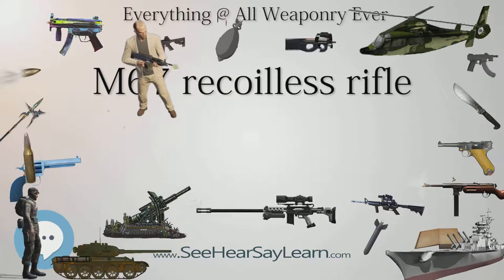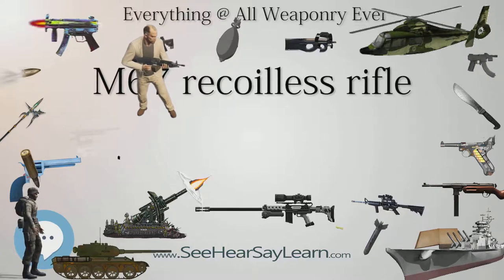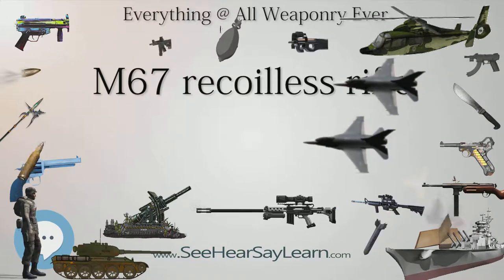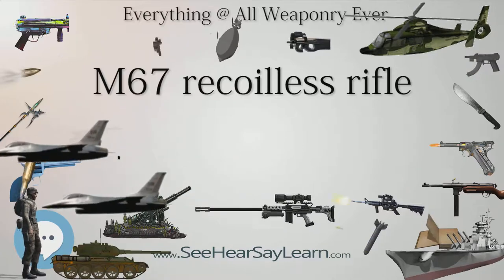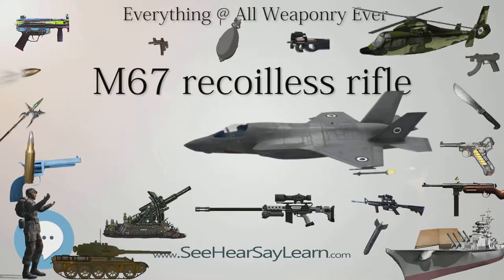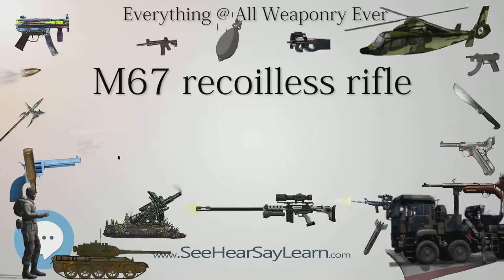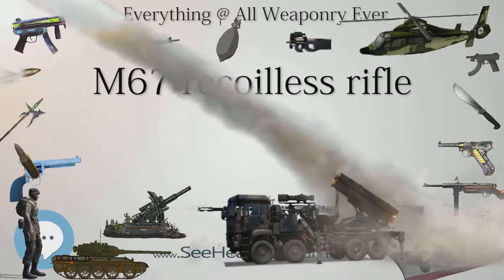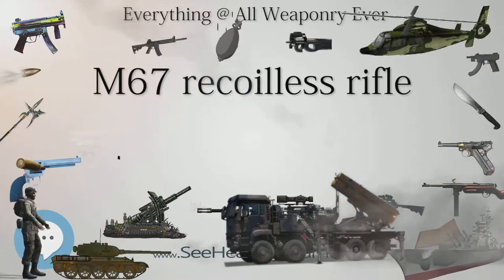The rapid firing was limited to five rounds, with a mandatory 15-minute cool-off period afterward. The M49A1 subcaliber device, which uses NATO 7.62mm rounds, is typically used for zeroing the sight and for qualifying purposes. The sight would be visually zeroed by setting crossed strings over the gun barrel opening — there was a rubber loop and notches at the end of the barrel to facilitate holding the string in the correct position — then looking through the barrel of the subcaliber device and crossed strings, and setting the fixed stadia reticle sight to the same target. The subcaliber rounds could then be used to further refine the zero and to qualify.